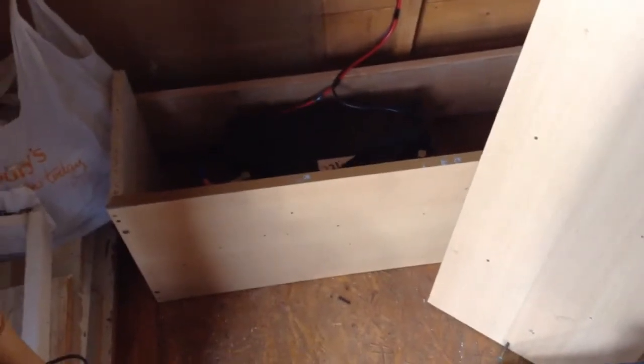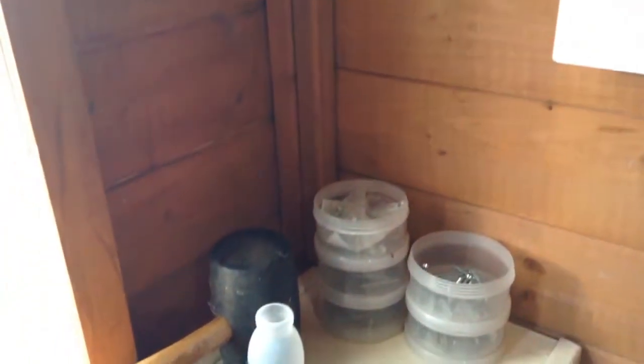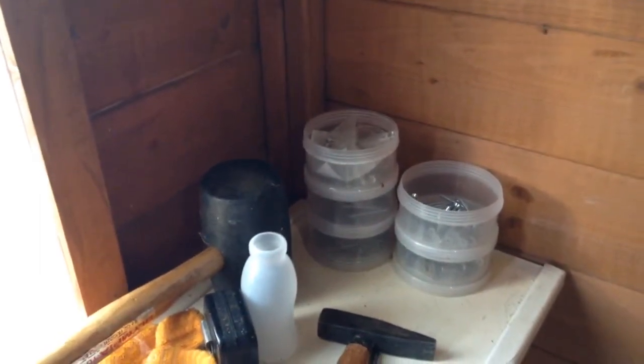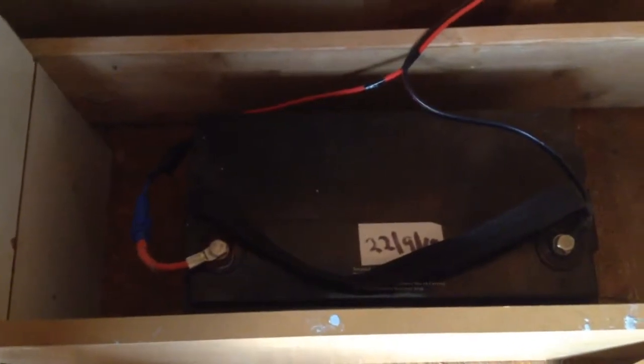As you can see, there's a battery box down here and I have upgraded the battery I was using. I was using a 20 amp hour battery before, but when I was running the water pump — which draws the best part of 5 amps — it caused the battery voltage to drop to 11.8 volts, which was a bit low. I needed a bigger battery, so I built a battery box with a cover to stop anything falling in and causing a short circuit. In this box is a 100 amp hour deep cycle battery.